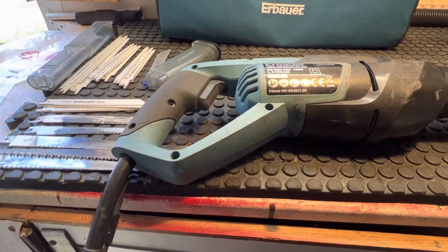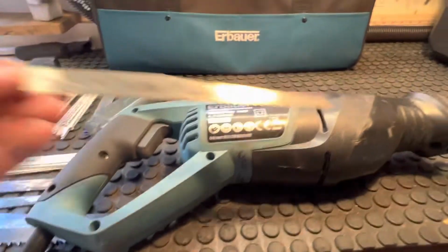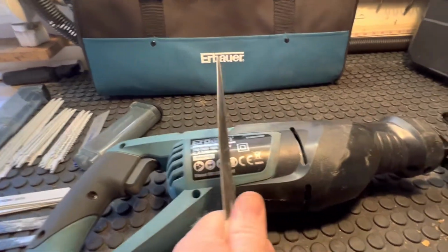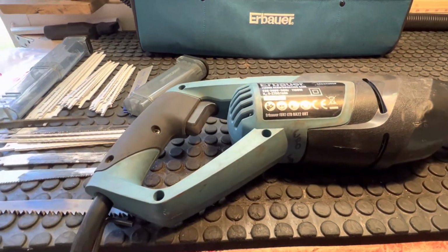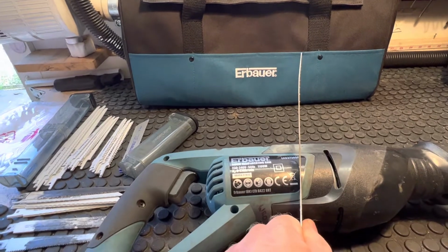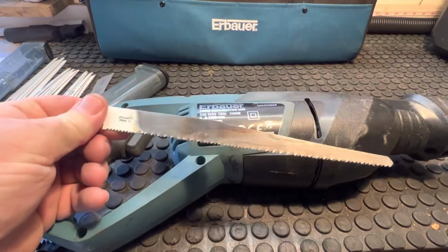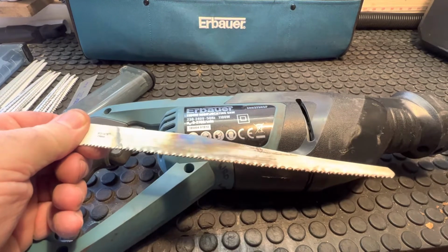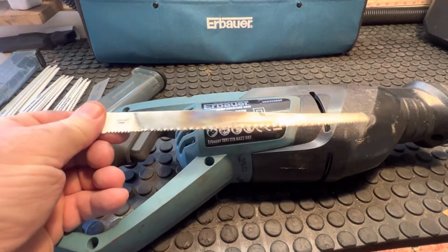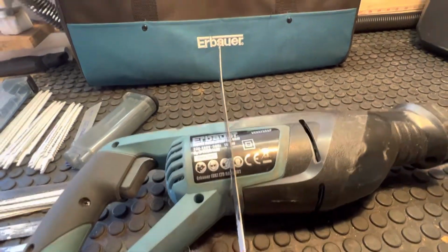I'll tell you one thing I wouldn't use it for. I'll use this blade here. What I tend to find, see when it's in the machine and cutting, this one is perfect to show you. Look at the end of it, guys. If you use them constantly, they start to bend. They start to warp. See the colour in that metal, about where the writing is, that kind of bluey colour? I've been cutting branches with that, and when we're constantly using it, that blade has been heating up. And as I say, it makes them bend.